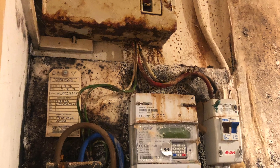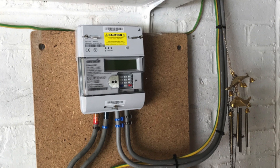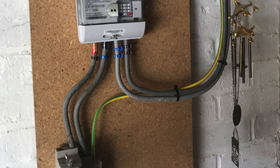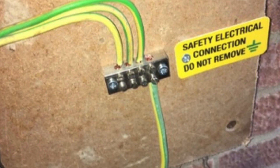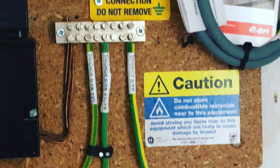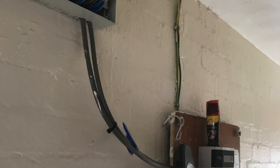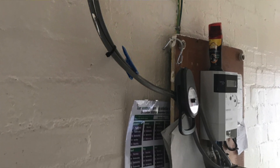The first thing I do is start off at the mains — I look at the supply characteristics and take a photo, because that will come up later. I make sure the main earth terminal is labelled, it's present, and has the correct terminations. I also take photos of that and make sure the main tails are supported throughout their lengths so they can't be pulled or caught in a door.